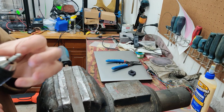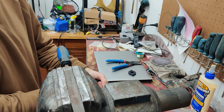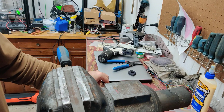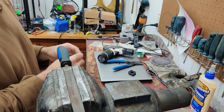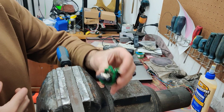That's looking really good. I had already done it so it went really fast — it might take as much as two minutes normally. Be careful because that heat break is hot now. The next thing we want to do is line up the hobs so that they're perfectly even with the filament path.